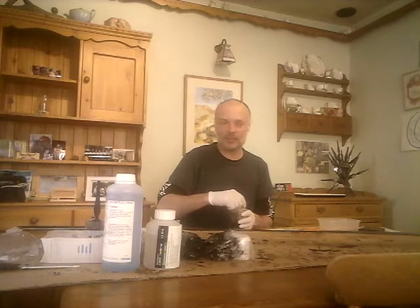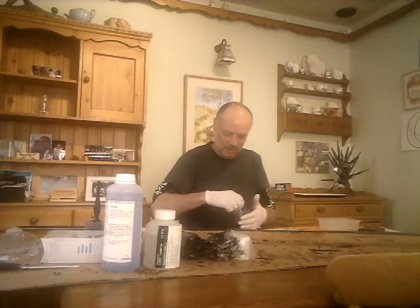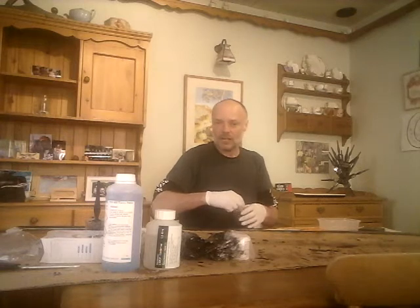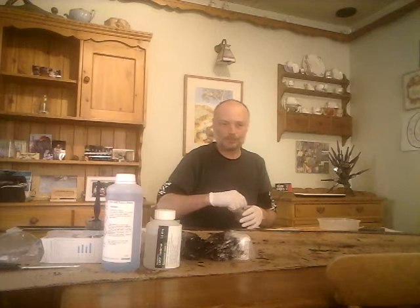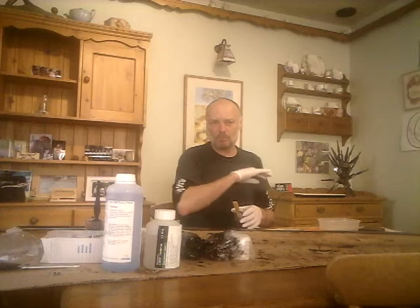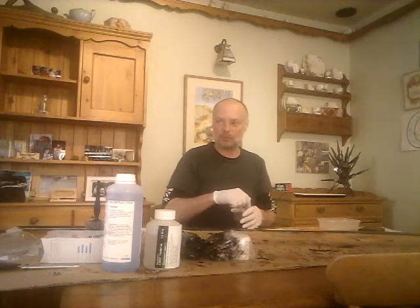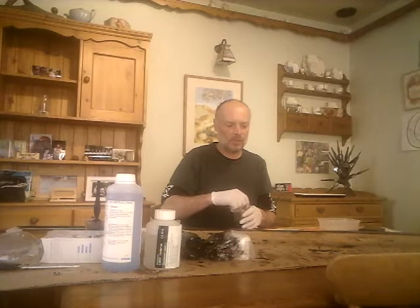I've made quite a few and they've been on for being a very nice bow. But unfortunately, being an idiot, I've gone too hard in with either a scraper or used a plane when I should have used a bit of sandpaper. Just by taking that little bit too much out means that the bow drops pounds and pounds in draw weight. And even though you get a nice looking bow, it's not exactly properly usable.